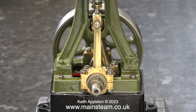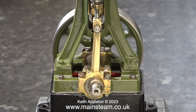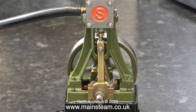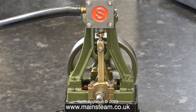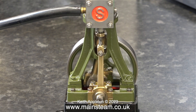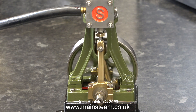Apart from the wonky flywheel, this engine is really good and it's running extremely well. Running slowly — without slow motion — you can see and hear how sweetly this engine runs. By blasting the bearings with WD-40, it's now running much cleaner as all the dirty oil has been flushed out, so I stopped the engine and re-oiled it.